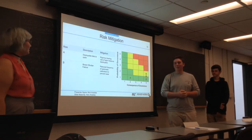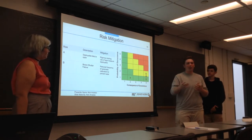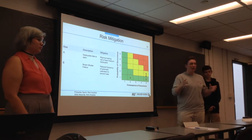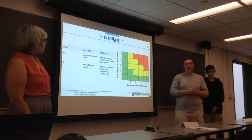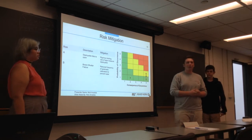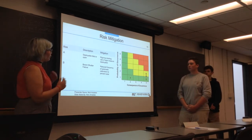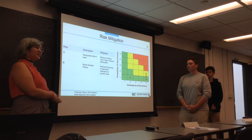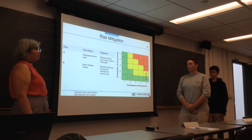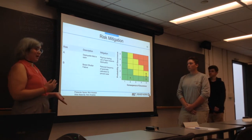For the Boson shutter failure, part of the CONOPS considerations were about how often we were going to take images — we didn't want to put undue stress on the Boson shutter by having it open and closed excessively. By taking fewer images, we're hoping to mitigate the risk of it suffering mechanical failure. We also talked about changing settings so that it only calibrates when absolutely necessary, which would help reduce the number of times the shutter actually closes and break down the risk of it actually breaking.